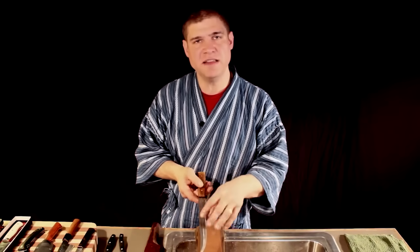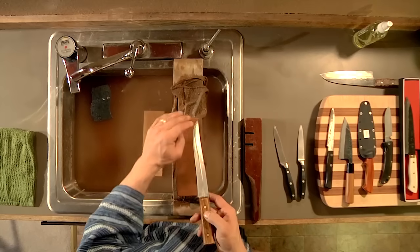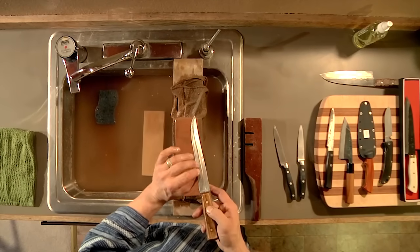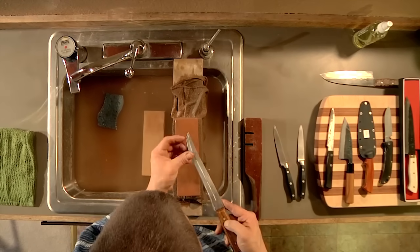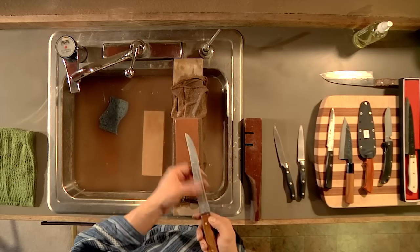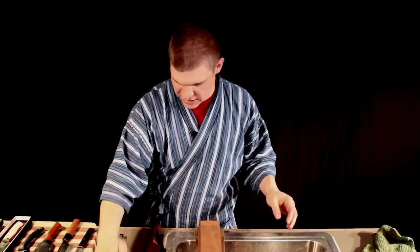Okay, so we've definitely made this blade better. We've thinned it down because it has a slight hollow grind on it. Parts of the middle of that secondary edge have not made contact with the stone yet, but in subsequent sharpenings they will. And in fact, up here towards the tip, we've actually ground one section completely flat. Okay, that's complete step 4 for that knife.